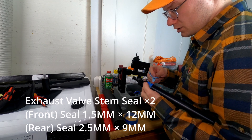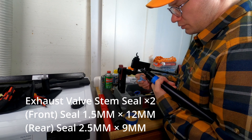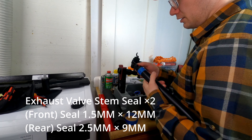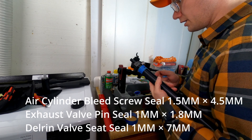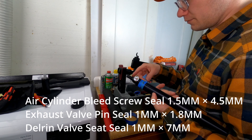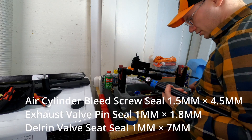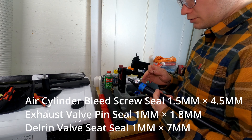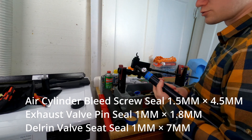I'm just going to change this O-ring because it was only a few weeks ago that I installed the regulator for this cylinder and had new O-rings for it. The reason why it broke was that it was moving a little bit on the action. So remember, always tighten the grub screws properly.